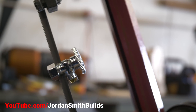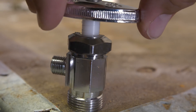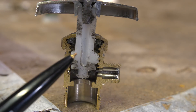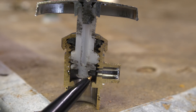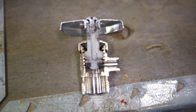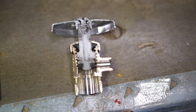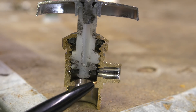First, let's start with the standard one. This is a compression fitting, and the way you can tell is you're typically going to see a plastic stem at the top. This one's going to take multiple turns to actually get it to shut off. When we cut this open, here's what it looks like: that plastic is going all the way down until there's a rubber gasket, and that rubber gasket is making contact with the brass, and that's actually what's shutting it off.